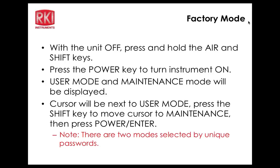All right. I had a question, Bruce. Any chance of getting that HC option instead of just CH4 or HC, LEL, so that it just has a big LEL on there? I get some users who just don't want to see CH4 or HC. Just say LEL. Well, it always shows LEL. If you look at the screen that John's showing you right now, that CH4 can be changed to HC, but you can't get rid of it totally. It's got to be one or the other. Yeah, and I wouldn't want to get rid of it totally. I want to replace it.